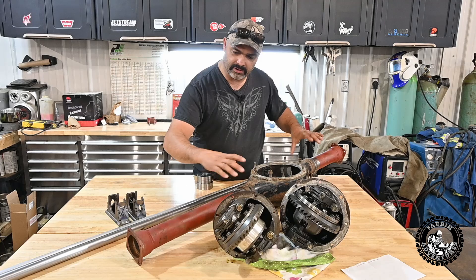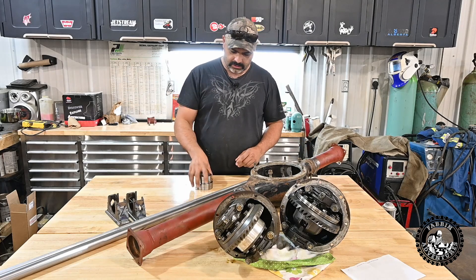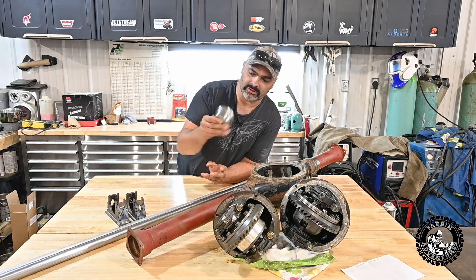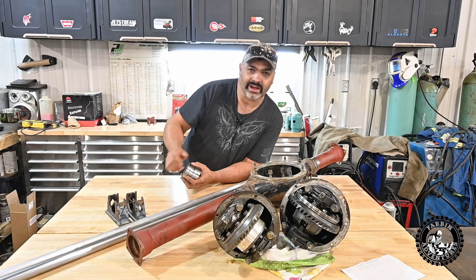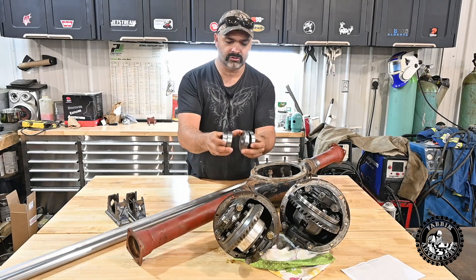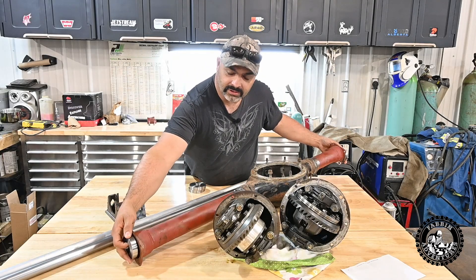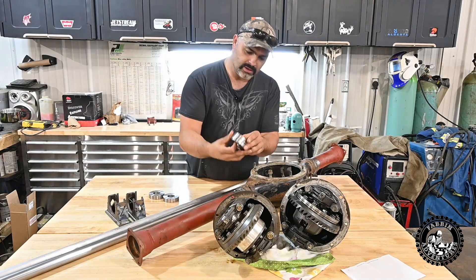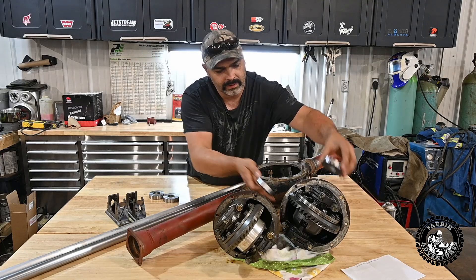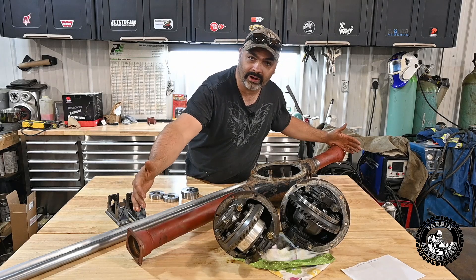I mounted all this in there, set it up. I just put a couple of big tacks or stitches to hold it in place and I want to check it out. So I want to give a shout out to Summit Machine in Hinton, Alberta for whipping me up these pucks and supplying this big shaft to check straightness. There are two sizes of pucks here. These smaller pucks replicate the outer wheel bearings of this axle. These bigger pucks replicate the bearings inside of this third member, and the shaft will run through all of those bearing look-alikes.